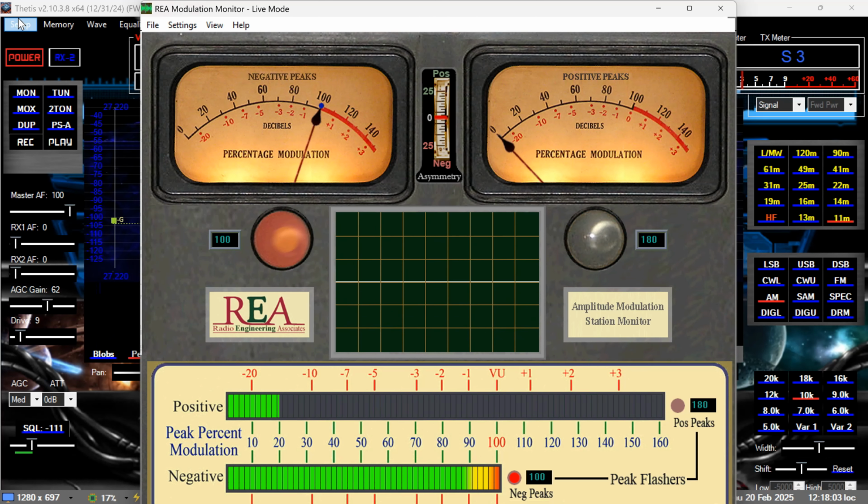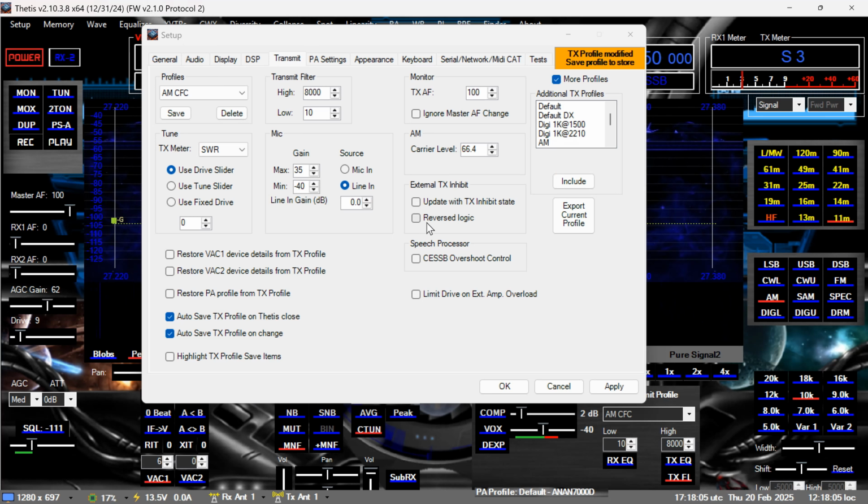Okay, let's turn this back. Let's go the opposite way. Let's undermodulate this. Once again, I'm going to key up and bring this carrier level up. Keep in mind, the peak output power never changes when you adjust this, only the carrier. So watch the carrier level. I'm going to bring it way up to be undermodulated. So watch that 2 watt carrier rise. Here we go.